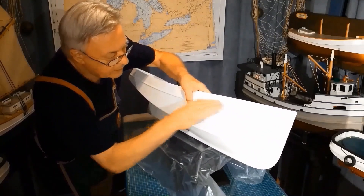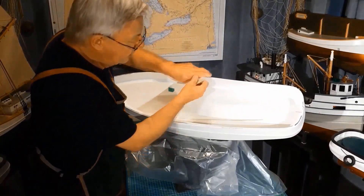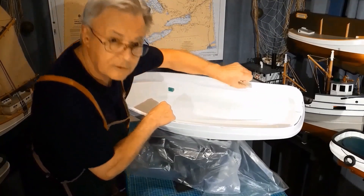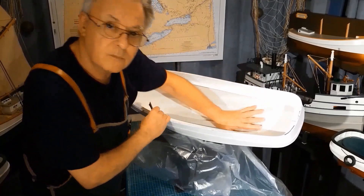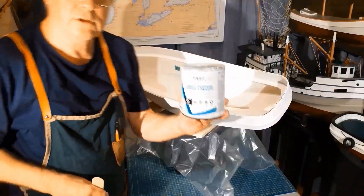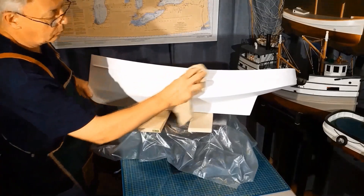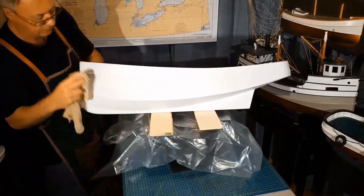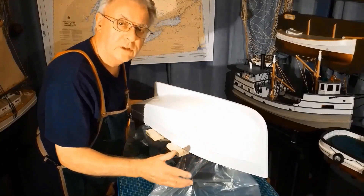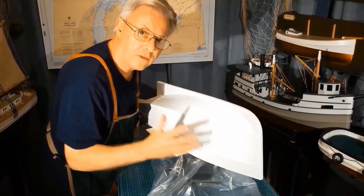I spent approximately one hour so far sanding the hull. We have to sand the upper part of the deck plane and the inside of the bulwark — that's going to receive primer as well. The inside we don't touch; we just leave that as gel coat. We're ready to paint. Here's the latex multi-purpose primer sealer we're going to use. Just run your rag along the top railing area. There's the first layer of latex. We'll let it harden up for 24 hours and then put one more layer of latex on the hull tomorrow.